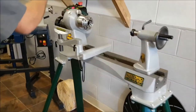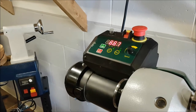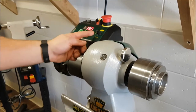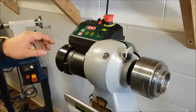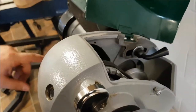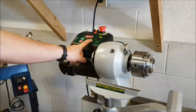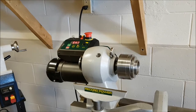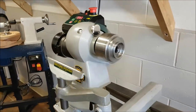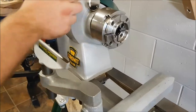The motor and electronics have a really interesting system. When you adjust the speed it shows you how fast it's going, and you can actually pre-program the lathe for a target speed before you even turn it on, then adjust midway through. Opening up the headstock reveals three pulleys on the back for your torque settings, and you tell the control panel which setting you have it on. Reversing is easy — just hold the button, it'll beep and pop into reverse for sanding and similar tasks. It's also a slow-start lathe, so for larger pieces things aren't going to full speed right away as a safety feature.